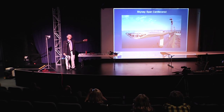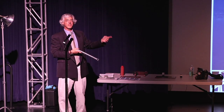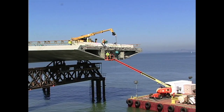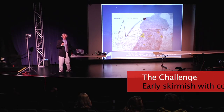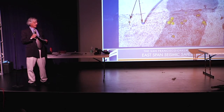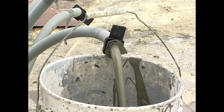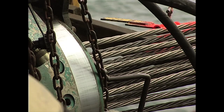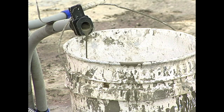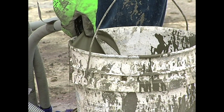This is a shot of the skyway when it's cantilevered out — supported on one end, wanting to sag down. So instead of regular reinforcing steel, we bring in pre-stressing steel, which is five times stronger. Regular plate steel is about 50,000 pounds per square inch; pre-stressing steel is 270,000 pounds per square inch. The challenge we faced: on the skyway, some grouting vents had broken off. We fill the post-tensioning ducts with high-strength grout after pre-stressing is done, and the vents need to be capped. Some trucks had probably run over them and broken them off, and when it rained, water got inside those ducts. Water and steel don't work very well.